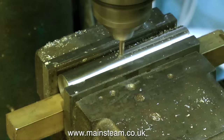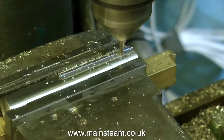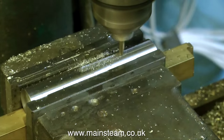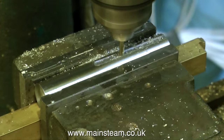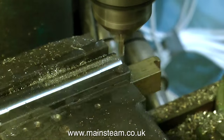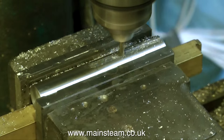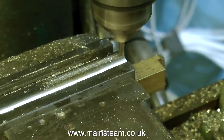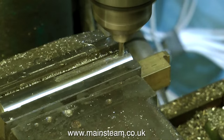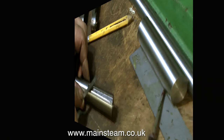Then I put in the blank piece and I'm milling a slot for the keyway. This is a very slow, laborious process on my small milling machine — it takes a long time and you must not rush it. This is quite a fine cutter, slightly smaller than I need, because if you use one that's a little bit bigger it's always going to cut oversize. Because I'm winding a handle — it's not a computer machine — I will wind the handle too fast, the tool will bend, and it will cut oversize. So I'm using a smaller cutter and then I will finally do some passes down either side, and we'll end up with it just the right size.